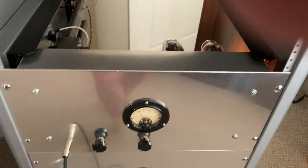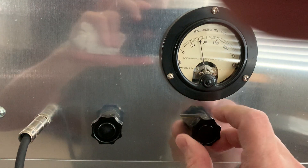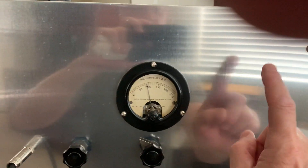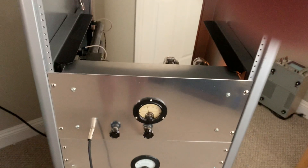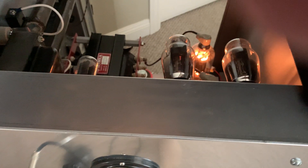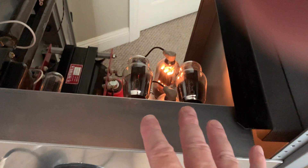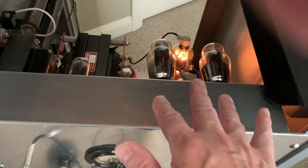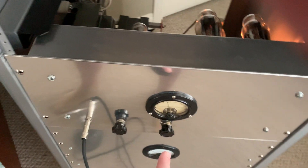I do want to replace this one meter here — this is the one for the 6A3s, and the resting current is supposed to be around 80 milliamps. This is the general purpose speech amp driver circuit from the old William Moore handbooks. The mistake is that for 6A3s, 2A3s, or 6B4Gs, you need to adjust the bias on each tube independently — not together. This single pot is doing both at once, and there's going to be an imbalance. I saw the imbalance on the scope a few years back and just swapped wires to invert it so the hottest side was for my positive peak.